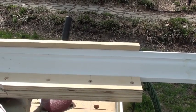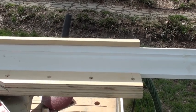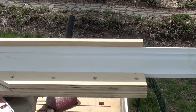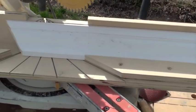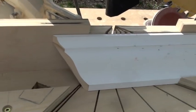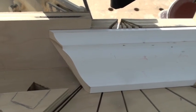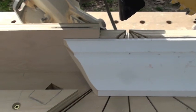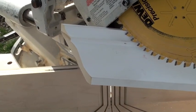I'm shooting video by myself and I'm going to try to do this as much real-time as possible. In case you see an image of my miter saw, do not operate your saw that way — I'll try to keep it out of the picture. What we've got here is a piece of three and five-eighths paint-grade pine, not MDF. It's been nested in the stand and cut so the back edge is wider than the front, so I'm going to flip it.